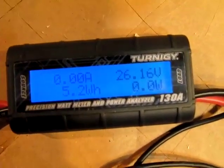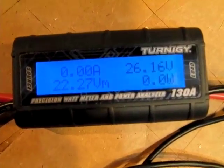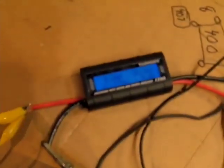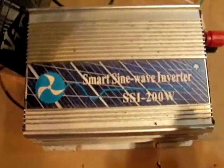You can look and say the DC side is using X amount of watts going through there, and it's useful for testing grid-tied inverters because you can look over here on the AC side and see what it's producing versus what it's doing on the DC side, and you can see how much inefficiency the inverter has.